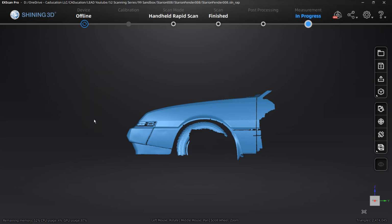And this means that we've taken our point cloud, we have aligned two scans, we removed two of them that we ended up not needing. We aligned two scans, we manipulated the point cloud data by removing some of it before we converted it to a mesh. Once it was converted to a mesh, we then went back and manipulated that mesh data. We filled holes, we smoothed out some areas, we allowed it to process the mesh and do some level of smoothing across the entire thing to make sure that we have a good result.